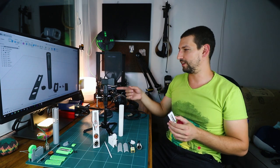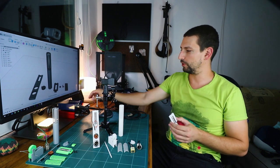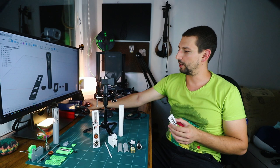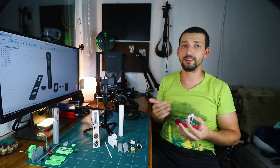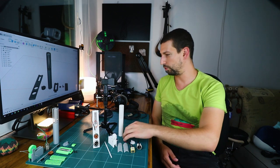The Cloudlifter uses the audio interface's 48 volt phantom power to boost the signal and protect the mic from the phantom power at the same time. I guess it all depends on your source volume and your audio interface preamps. I personally prefer recording at bedroom level.